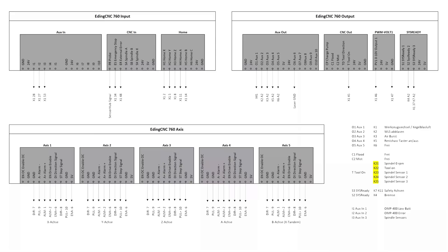Coming back to the actual board connections. There are three digital inputs: two related to the Renishaw touch probe detecting low battery and general error status of the probe, and one related to the ATC spindle piston position sensors. This is important to detect a wrongly inserted tool holder during the automatic tool change sequence. Further, there is a probe input, the e-stop input, and an external error input which is triggered in case of a spindle VFD error. And finally, the homing sensor inputs for all axes. On the output side, there are the digital outputs that switch the relays, the tool-on signal that starts the spindle, the 0 to 10 volt signal that determines the spindle speed, and the system-ready outputs that release the Z-axis brake and connect the servos to power. The axis connections have an enable signal which turns the servo on, an alarm signal going back to the control board in case of a servo error, and a step and direction signal to drive the servo. And that's all there is, so not really complicated at all.